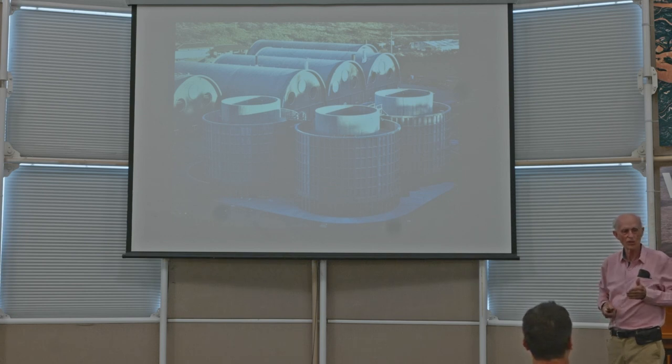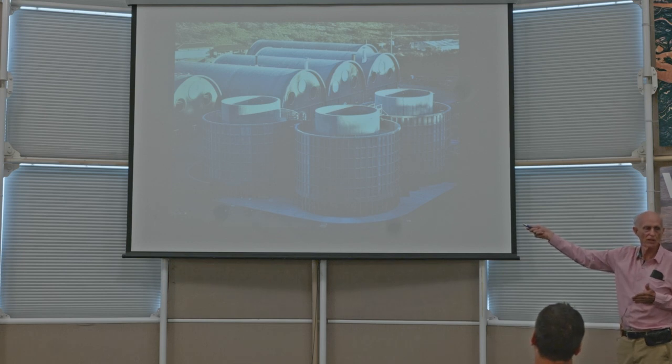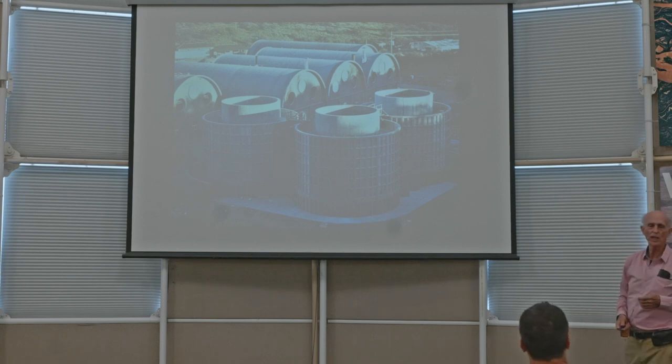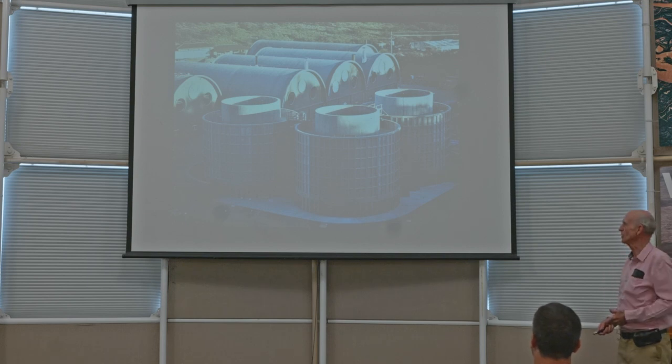That's how Biosphere 2 is cooled, by the chilled water that comes from the energy center and the tower water, which is evaporatively cooled, which is carrying the energy. It's not the water that's being exchanged. It's the energy in the water that's being exchanged.